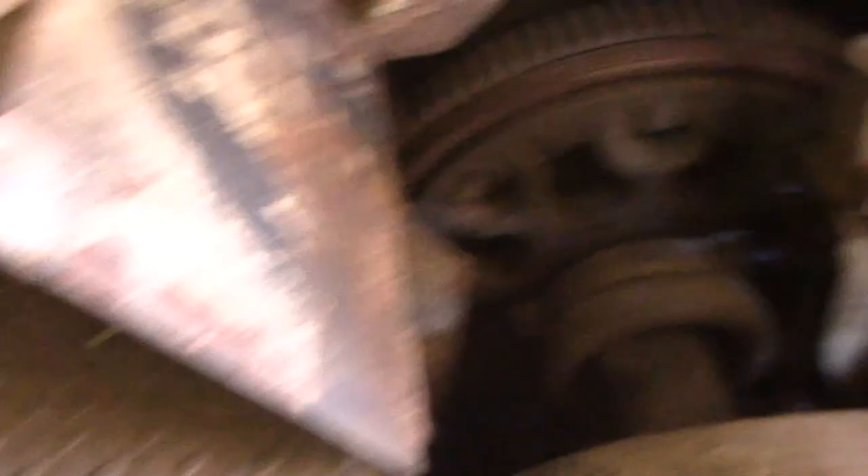Here's your swing shaft. You've got the shaft going up, helical gears here — they all look good. That turns your swing shaft, and the swing shaft's got a gear over there which turns a big bull gear. That bull gear lets you work your clutches.